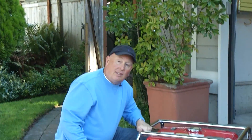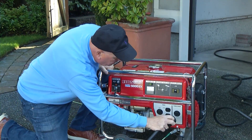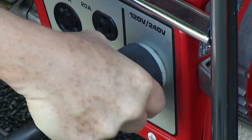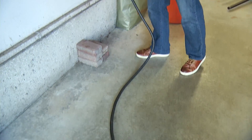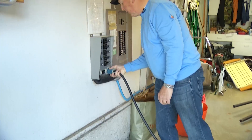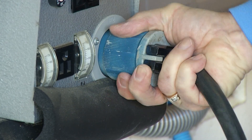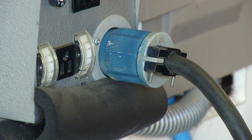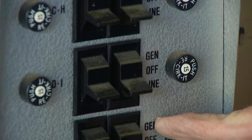You're going to need to take the power from the generator and put it into your house. There's a plug made specifically for it — it goes in and you give it a twist to seal it. Then you take the power from the generator to the house through the gen-trans switch as the twist lock secures it. Once the generator is running and it's transferring power, you move these switches to the generator position.